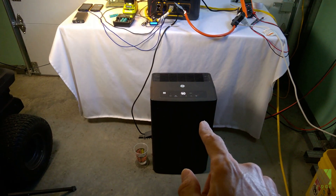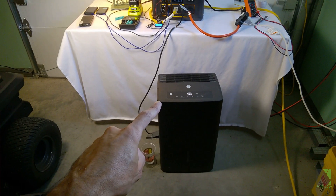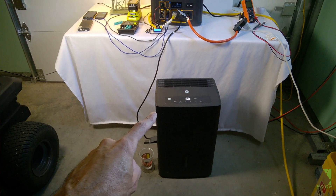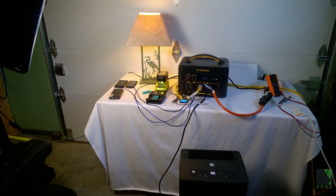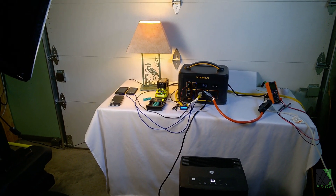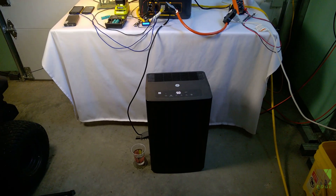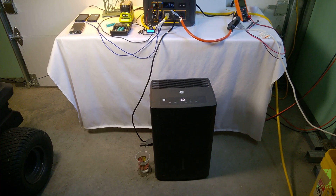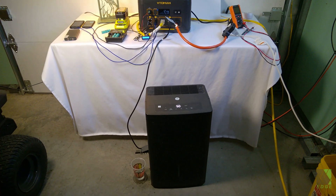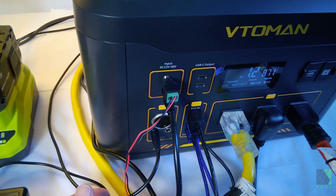Just to be clear, they're both running right now. However, when I tried to run the air conditioner and then start the dehumidifier — so I had to start the compressor — what happened is the CFL bulb in that lamp immediately blew up. That is not a good sign. So what is the conclusion? If you're going to push a high-frequency inverter that hard, don't plug sensitive electronics like computers into it — otherwise you might lose them. Something to keep in mind.